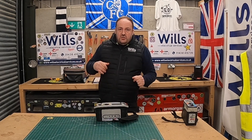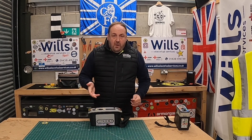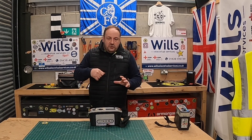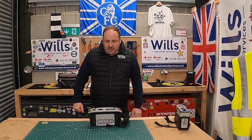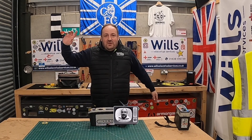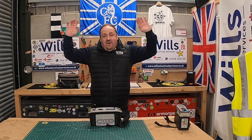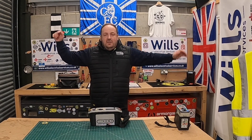It's an absolutely beautiful bit of kit - very expensive, but awesome. The earth loop impedance is a lot quicker than it used to be; Fluke used to beat it on speed but it's better now. The 2-wire earth loop impedance is priceless - before, you'd sometimes have to put the neutral and earth prong together to get a reading, which isn't the best method. Anyway, I hope you like the video, and if you could like, subscribe, and turn the notification bell on - I hope you enjoyed it. Don't forget: if you're going to be anything this week, be electric. See you later, thanks for watching.